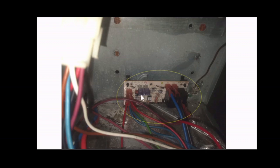And of course, that's after you replace the fuse and you may have found out that the board is still bad. Maybe the board looks burnt, has a burnt spot, looks damaged in any way, any of the components. It has a lot of resistors, perhaps some capacitors, and coils or chokes. You may have other components. So make sure all those components are intact. Inspect the board from front and back. Make sure that, again, there is no obvious damage to it. If you suspect in any way there's damage, I would replace it.